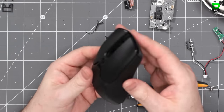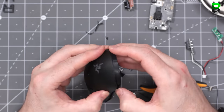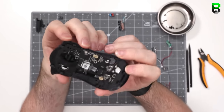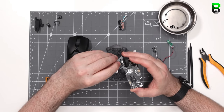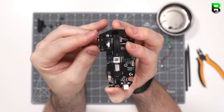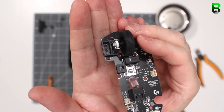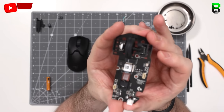The rear of the shell clips into the base, which is pretty good — you won't need any screws to hold it in place. Check the fit, put the PCB in and make sure it fits okay. Make sure you put the power button in, which is what I always forget. You're going to need these little printed brackets that push into the side of the encoder, which is a 10 millimeter TTC. There's also one for the other side — these sit over the top of the switches and hold them in place.